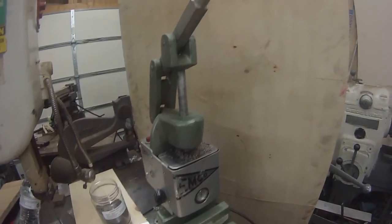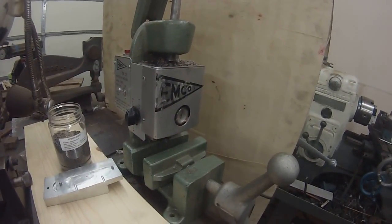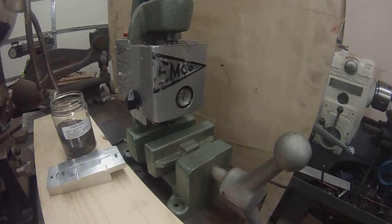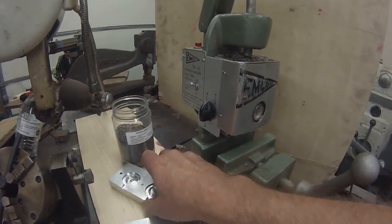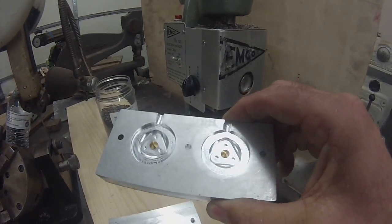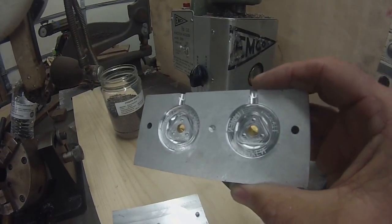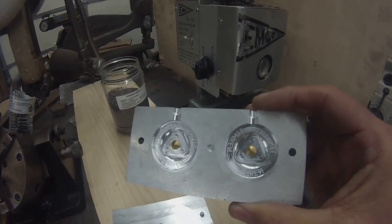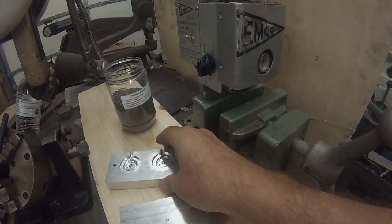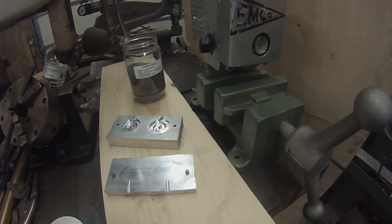We'll have to wait and see. This thing has very little capacity, size-wise. But it's something to play with, something to learn with. I made these dies up maybe a year ago — they've got little extractors in the center of the brass pins that push out. That also doubles as a countersink for a flathead screw that holds them on where they go.